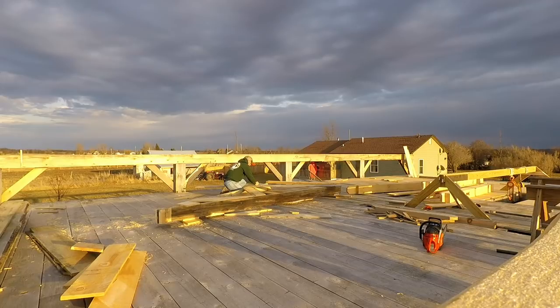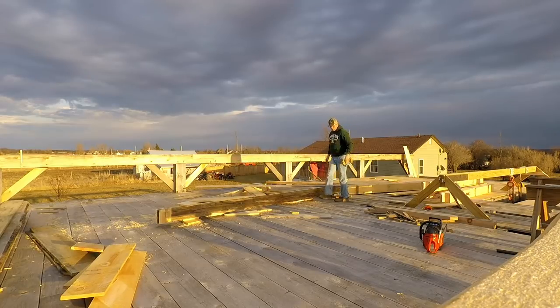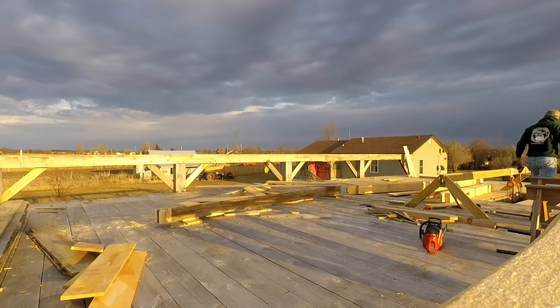Now this thing isn't terribly heavy. I mean, it's stout. It shouldn't go anywhere. But it's not so heavy that one guy can't stand it up on his own. I've seen some sets of shear legs that are just massive, and they do a job. I could have used a gin pole, but I really like the stability of the shear legs better. What's nice with the shear legs is you can attach block and tackle to the bottom and at the top, and then if you have a couple sets of people pulling on it, you can lift a lot of weight with these things.